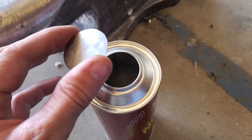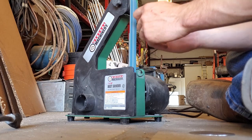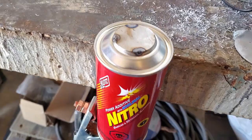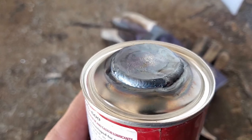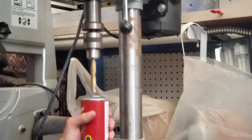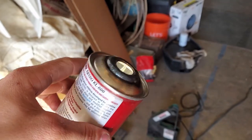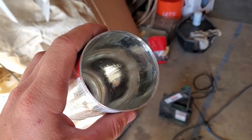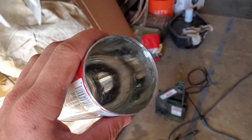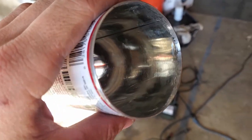Super easy — just cut them close to shape with tin snips, sanding them down a bit on the belt sander. A couple tacks later and it looks like it's in a pretty good spot. I then close the gap by running a bead all the way around. Now that our ring is in place, we need to drill a hole in it so that our exhaust can flow out of the end of the can. I'm using this end of the can for the end of the pipe because it's slightly cone shaped — it looks pretty cool. On the other end, I'll weld a piece of 20 gauge steel, but I won't do that until the tubing is in place, the can is fully packed, and it's ready to be sealed up.